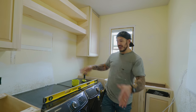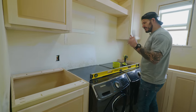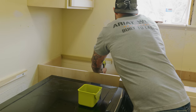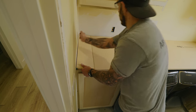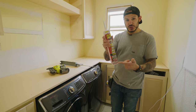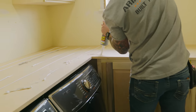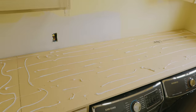The plumbing is all done. We're going to start working on the countertop so we can get to the point where we can connect the plumbing. It's going to be L-shaped across here. There'll be plenty of support for it except for one place in the back, where I'm going to use a scrap 1x2 secured through the studs. This will be the only overhang span, and I think it'll be just fine. We're going to brad nail it on top, cut out this little piece, then stack another piece over. We'll lay two full pieces and use the Flex Glue as the adhesive layer on top — it's a heavy-duty construction adhesive with instant grab, so I don't have to wait for it to dry. We'll put a bunch of it down, put the board on top, brad nail it in place, and then start working on the edge.